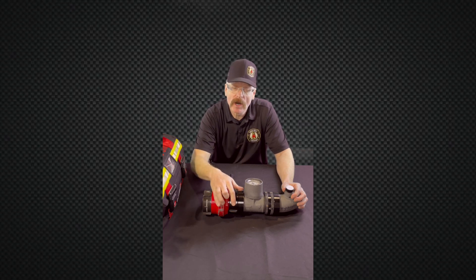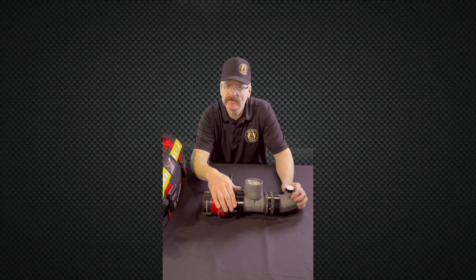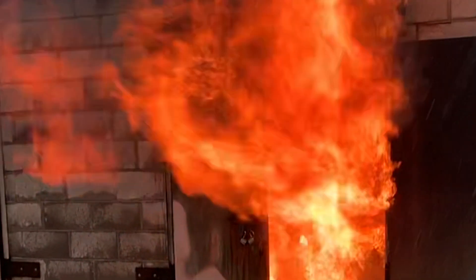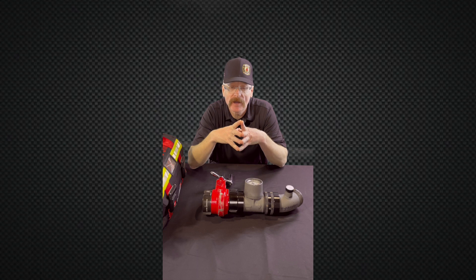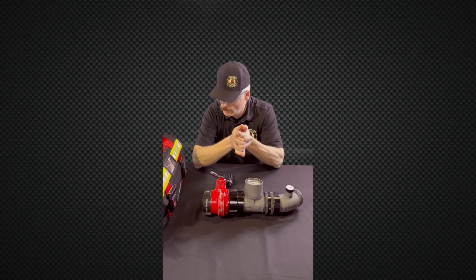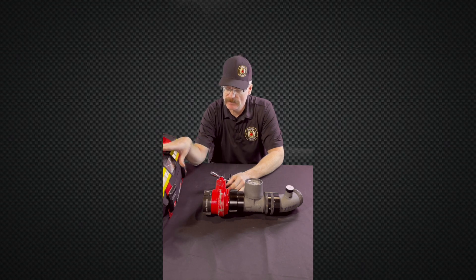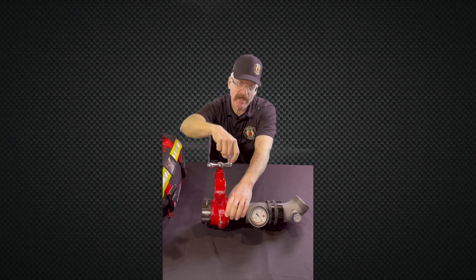During a firefight there's no such thing as water damage. We want to punch that fire in the throat and get it knocked down as soon as possible. The longer we let that fire burn, the longer we let smoke out of the fire unit and into the hallway and stairwell. High-rise fires are more smoke events than they are fire events — we need to stop inviting more people into our problems, and that's the smoke. If the building has a PRV system, it's required to be fully open, so we need to use our gate and gauge to control our pressure.